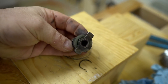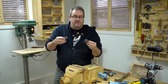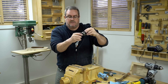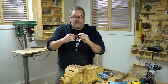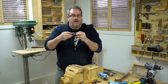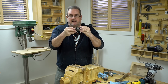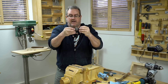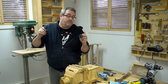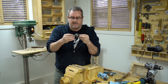So that is the anvil right there. Here's the way it works — it's easier to illustrate it here. As this is spinning, it'll meet the anvil. If what you're driving doesn't require that much torque, it will just drive it straight in without pounding. But if it starts to slow down to the point where it overcomes that spring tension on the back, this will slip past. Then it falls back in, spins around, and strikes — that's the impact sound that you hear. It slips and strikes and slips and strikes, and that's all there is to it.